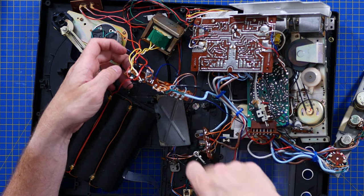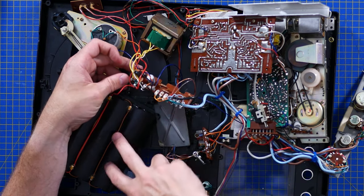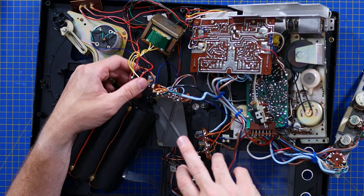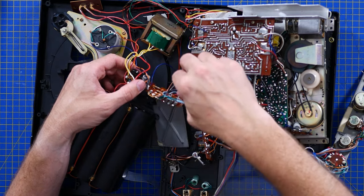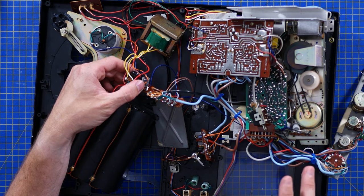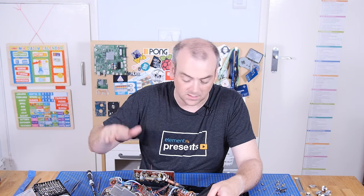I was a little bit confused why the stylus raw input from the vinyl comes all the way into this board — the input board that has the multi-tapping AC and the battery supply coming in. But what they're doing on this board is giving it a slight amplification boost and also splitting the signal into faux stereo at this point. So by the time it leaves on this black lead, it's already mocking stereo — there are already two channels to it, so they do that quite early on. And then the rest is all just line level exchange between tape deck, radio, all the other components and the amplifier ready to be output.